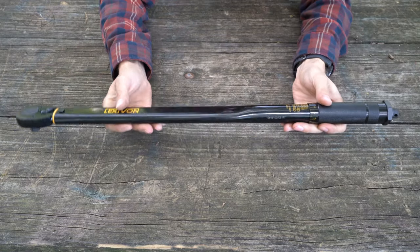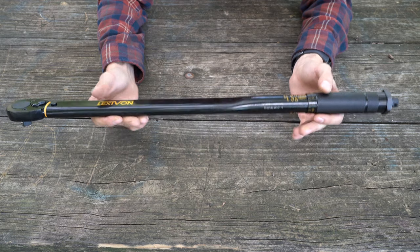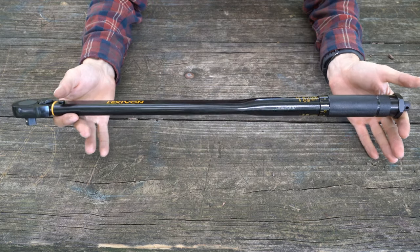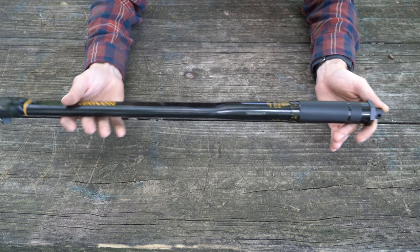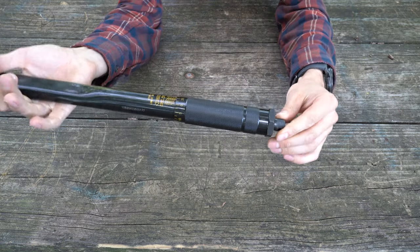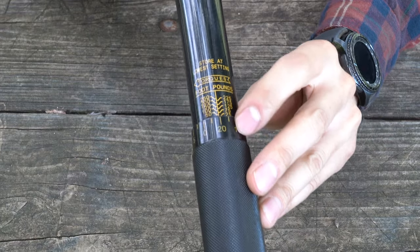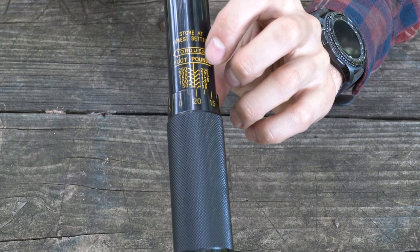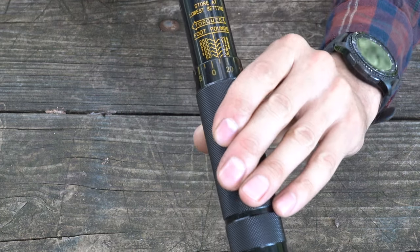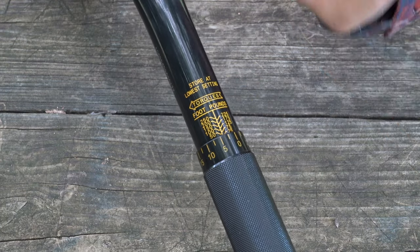And here's the tool itself. Let me tell you, it doesn't feel cheap, trust me. It's pretty heavy, it has a pretty long handle, so you can easily torque it to any specification you want. So right here, of course, it has the lock nut, so you untwist that. And then right here it has all the settings for between 25 and 250 pound-feet. So you twist that, and of course it has a partition in the middle, so you can go in between as well.